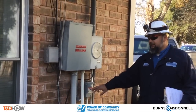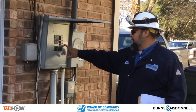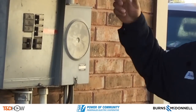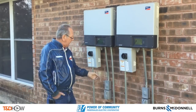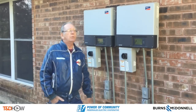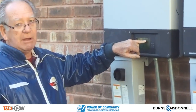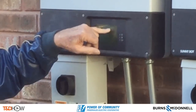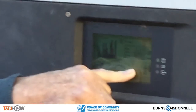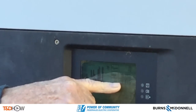This is the second source to the PV system. Here will be the breakers, also labeled caution — PV system circuit breaker is backfed, solar panel here. We turn it off to the backfeed and go into the meter. I've got a switch here: if I lose power, I can flip this switch up and draw 10 amps off of here and 10 amps off of here. I don't know if you can read this meter or not, but it tells you exactly how much power I'm making right now, which is zero because we've got no power on the system — it's not powered up. It tells you how many volts my panels are making, how many volts are going into the system, how many watts it's made today, and how many megawatts it's made since the system was put in.